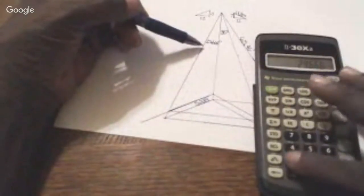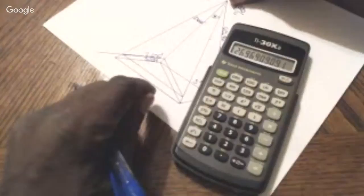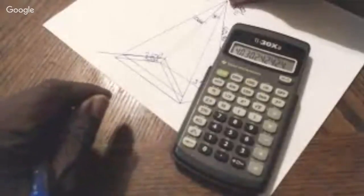We're going to divide it by 11, which is the rise, which represents this side of the roof. So divided by 11 equals 2.696. So we take this number, 2.696 feet, and we add it plus what's in the memory, which is recall 1, equals 4.03.